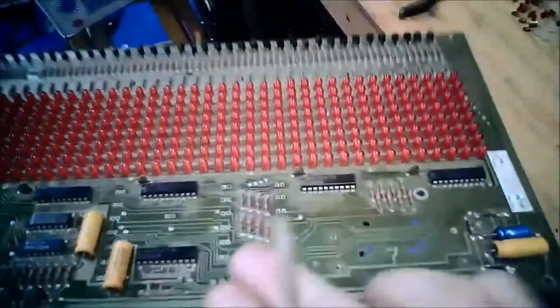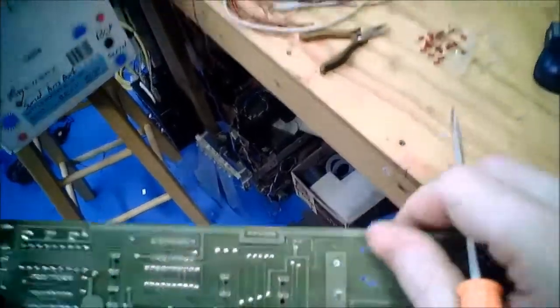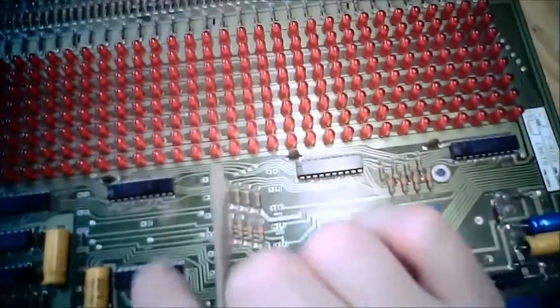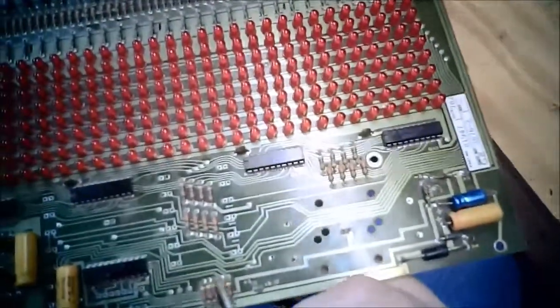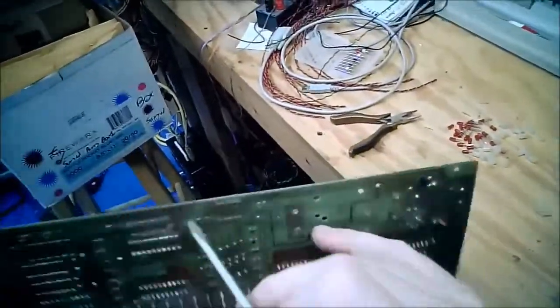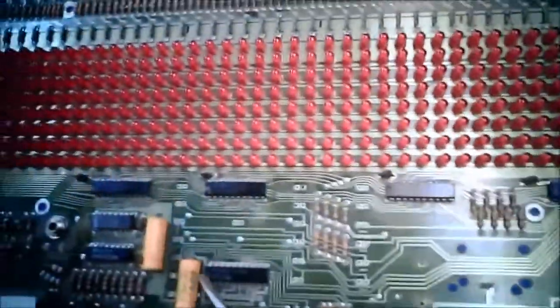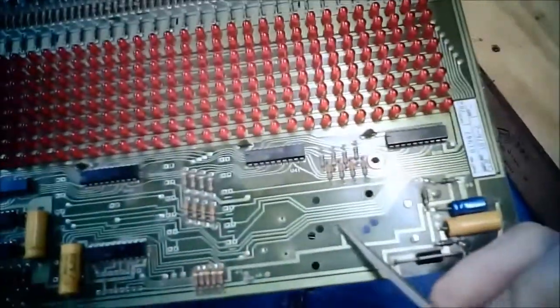So pin 5 went to that pin, which then went over to a resistor. So I'm guessing these are pull-ups for this connection. So when this guy was gated, these guys would hold the bus in whatever state it was last in. Now one of these IOs goes to this hole here. I'm assuming it goes somewhere underneath this guy, because I don't see it coming out this end, and I see it coming in here. And that is the tape busy LED.